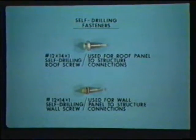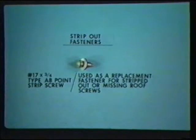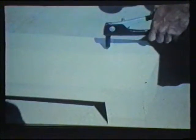Self-drillers are used to attach panel, trim, and hardware directly to the secondary structural framing without pilot hole drilling. Some manufacturers do provide drillers for side laps. Special self-drillers should be used for making sheet metal to sheet metal connections because of their tendency to strip light gauge material. Even with the right equipment, it is possible to strip a few holes. When this occurs, the fastener should be removed from the hole and replaced with a larger size screw, usually one with a larger diameter. Color-coordinated pop rivets also can be used in fastening sheet metal trims and flashings.